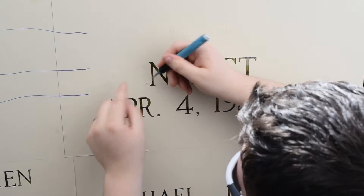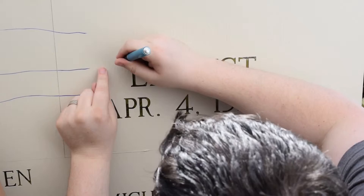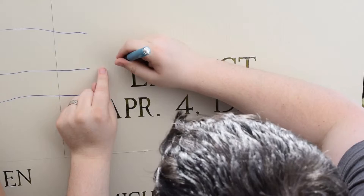And what's this here? This is called weeding. Once the stone is prepped, we take and peel all the lettering and design out of what's been cut out of the rubber, getting it ready for the sandblast part. So we're peeling everything that the plotter had cut earlier.